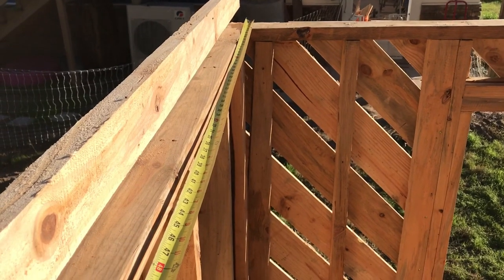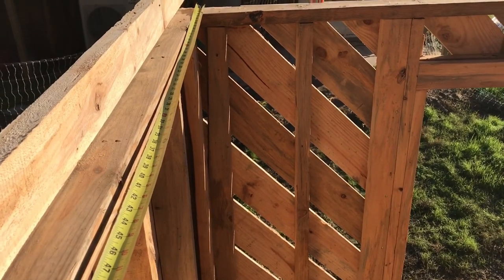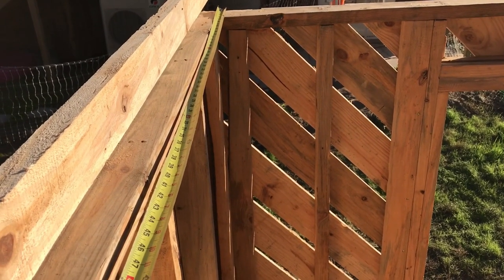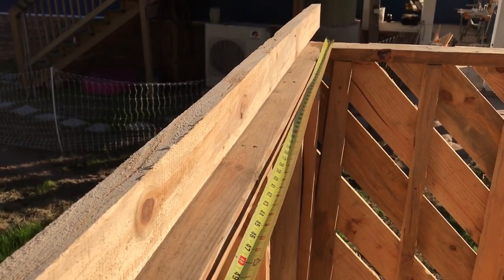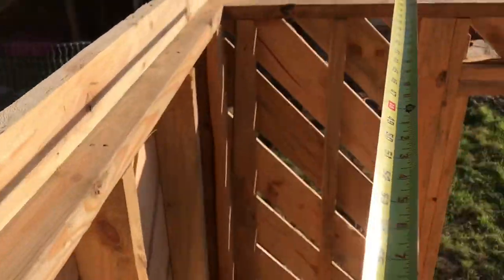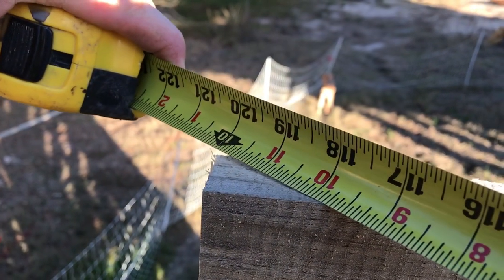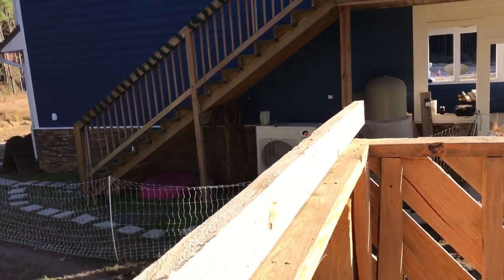I had kind of an epiphany — one of those things that rings a bell and you're like, oh duh, that makes perfect sense. The footprint of this shed is six by six, so the exterior of the top of the wall is six foot by six foot. I decided I wanted a one-foot overhang, so the beams sticking out to make my gables are eight feet long. I went to measure corner to corner to make sure it's square and got 120 inches — which of course is 10 feet. It's a hair off, within an eighth — it is square.